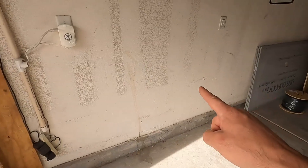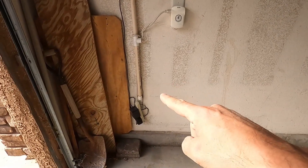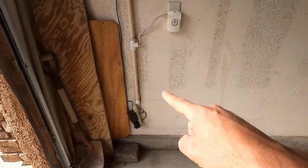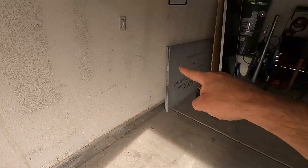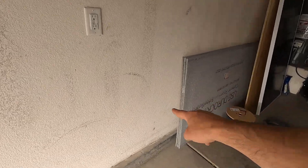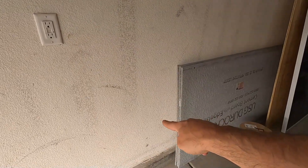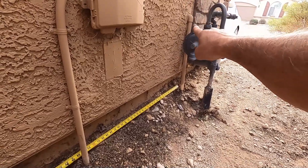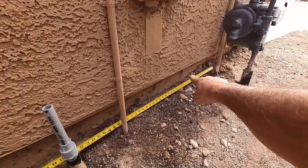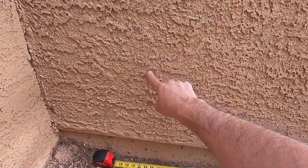The first thing we're going to do is figure out where we're going to punch our hole through the wall to the outside. This is our irrigation line and I think it's probably safe to say we'll use the same plane and go across here to about there. So from our irrigation PVC there, it's about 44 inches to our conduit and another foot where we're going to drill our hole into the wall.